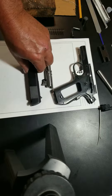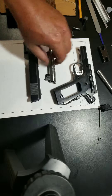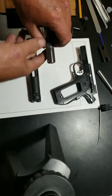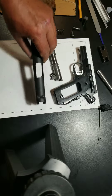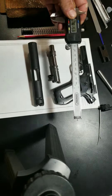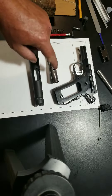It's actually a very difficult process, but I lucked out because there were a couple of things that allowed it to be installed fairly easily. The first thing I did was inspect the barrel and inspect the slide for fitment. The first thing I looked at was the hood, which is this little piece here. That little piece has a width and a depth which has to fit into these dimensions. I used a caliper set and measured the slide cutout as well as the hood dimensions. Lo and behold, they matched up beautifully — there wasn't anything I really had to do with the hood. The hood was just perfect.